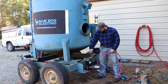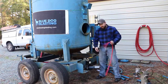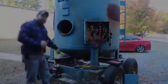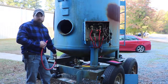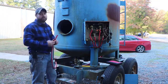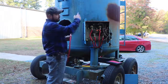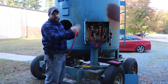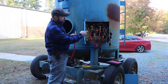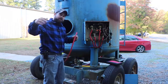We've got our coupled pinch hose through our pinch valve and hooked to the tank valve. In order to put air to this thing and actuate the spring-loaded valve inside, we're going to use a little bit of air hose with some simple crimp rings — slide that on. The air goes to your pinch valve but it's got to come from somewhere. This is an electric control unit, so we have our electric control box where all the air from the compressor gets actuated by an electrical signal.